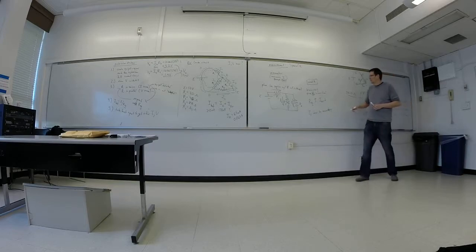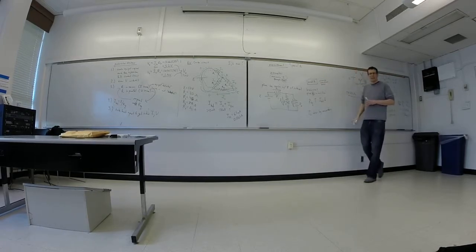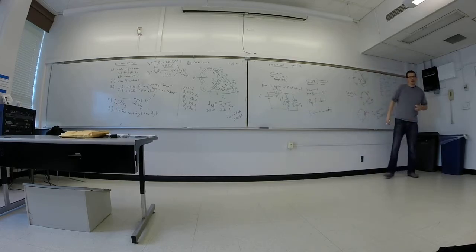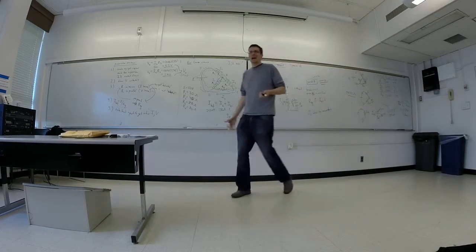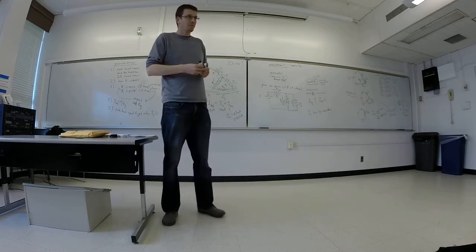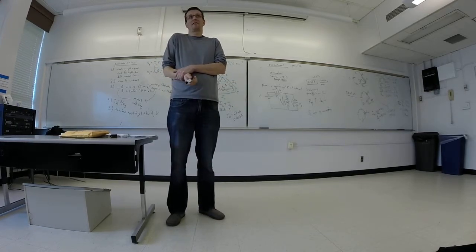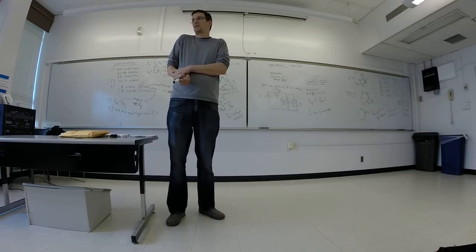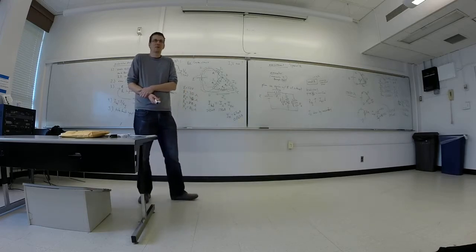That will minimize the measurement error. And that is indeed what happens with an ammeter. If you're lucky, the resistance of the ammeter will be on the order of, for a normal thing you might use in lab, like half an ohm. Now, half an ohm is significant if all your other resistors are half an ohm. But if the resistances you're working with are 100 ohms or 1,000 ohms, who cares about an extra half an ohm, right?